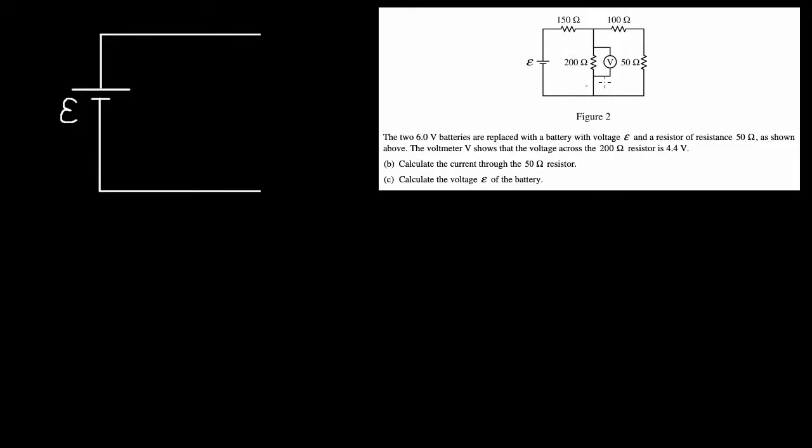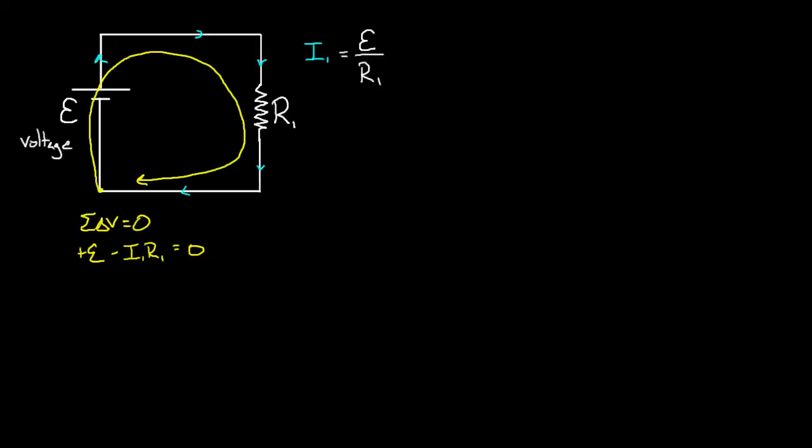So when you have complicated circuit diagrams with multiple resistors, you typically have to reduce them to a single resistor, and there's really just two ways we do that: resistors in series or in parallel. You figure out what equivalent resistance there would be and replace that section with a single resistor, and you simplify, simplify, simplify until you get to the case where there's one resistor and one battery, which we know how to do. Okay, so the next simplest case besides one resistor is two resistors.